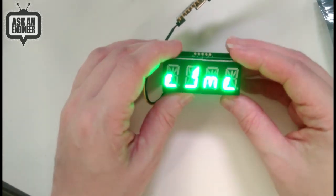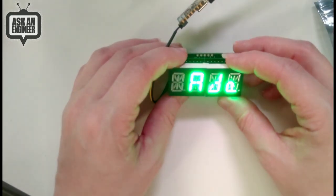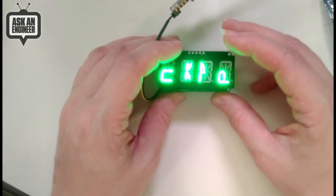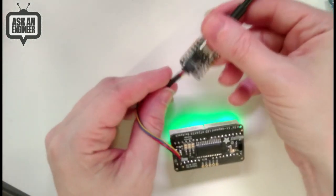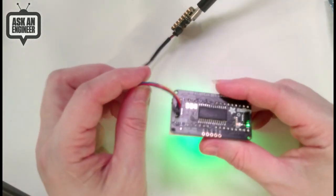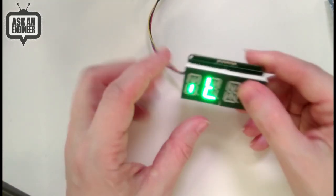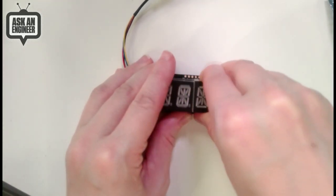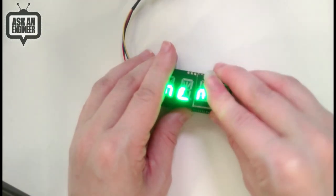Yes. And they work. This is great because it is really bright. The contrast is very good in person, but of course it's tough on the camera. But it looks nice. So now it's plug and play. I've got this STEMMA QT board, and I just have a connector going to it, so it's easy to plug and play. And then you can, of course, chain more displays if you like. For this one, I just soldered in Swiss pins so we could quickly change out the colors because I wanted to do this demo.